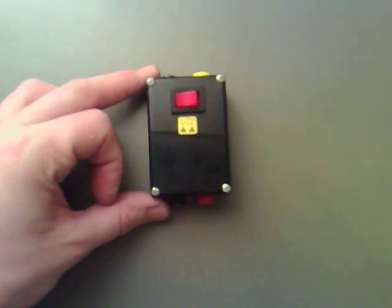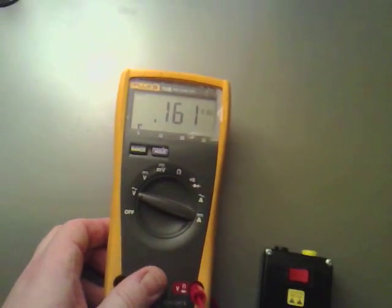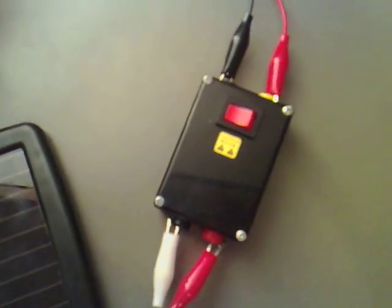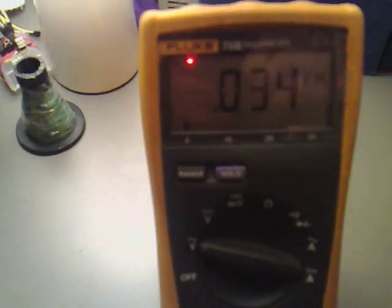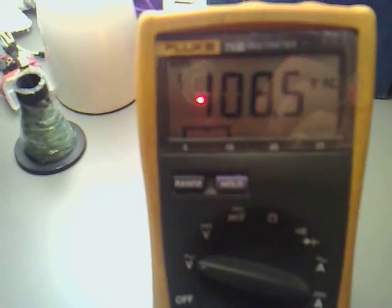What I'm going to do is use my solar charger to power it up, and my multimeter to see what kind of voltage we're getting out of either side. I've got my solar charger here that I've upgraded — I now have two batteries in it so it's 8 volts, and then we're regulating that back down to 5 volts, I think it works out at 5.1 volts, and that's coming round and into this little box here. The outputs go into the AC of this meter here, and if I switch this little box on, you can see that we're getting 108.5 volts AC out of that.